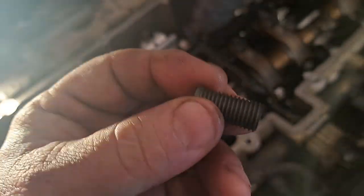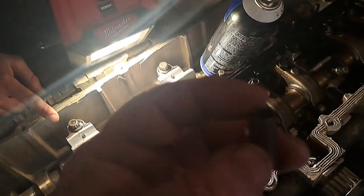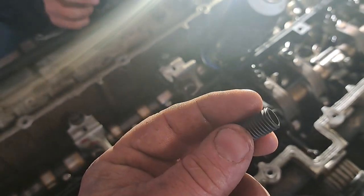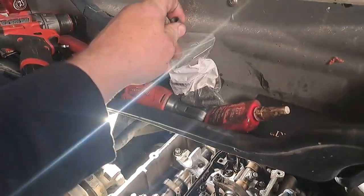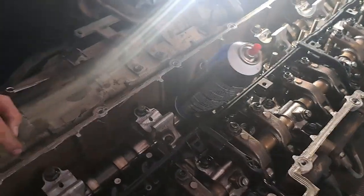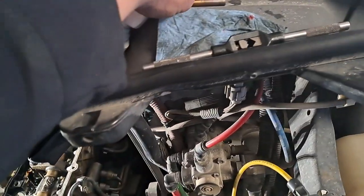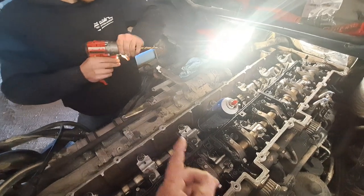One inch, got a lip, and this end is a little smaller. When it gets down in there, that installation tool goes on through and swells the bottom three threads into the aluminum you're working with. Let's go ahead and do the two we know are bad and then come back to that one — we'll probably end up doing them all. Trying not to get in a hurry, trying to do them right. We kind of only want to be in here one time. Left-handed drill — we'll move through to clean up the helicoil.